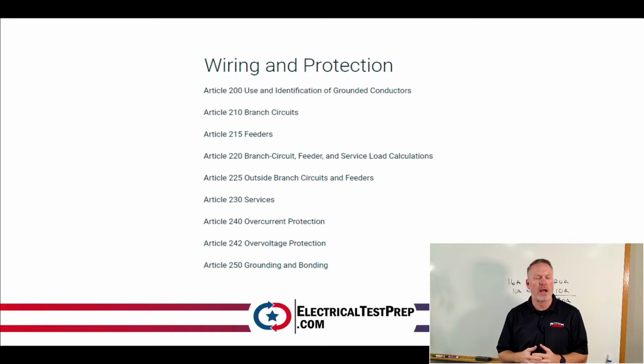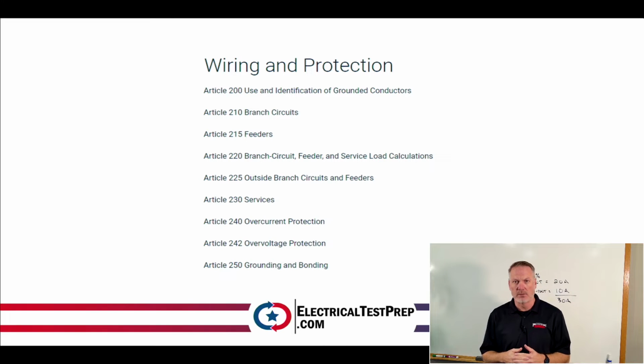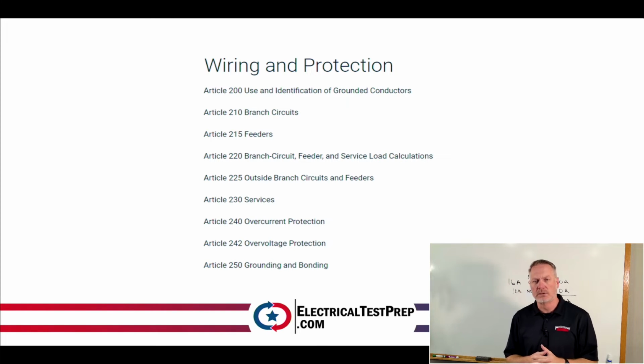And then we also have grounding and bonding. One of the things about overcurrent and grounding and bonding is that it's found basically all over the code book. It's not just found in those articles 240 and 250, it's all over the code book. So our default when we take a look at overcurrent and grounding and bonding is going to be to take a look at the piece of equipment that we're protecting, not necessarily just jump into 240 or 250, all right? And so that's going to be the posture that we're going to take when we get to those articles.